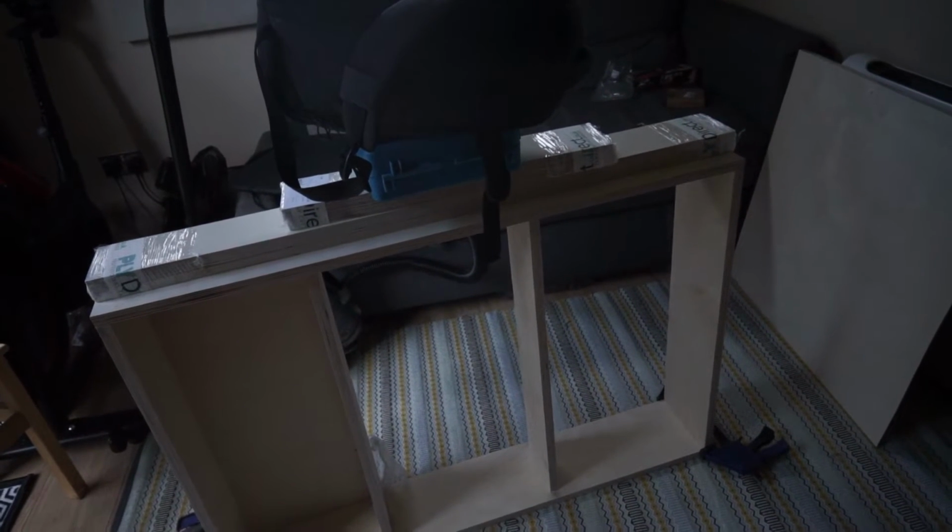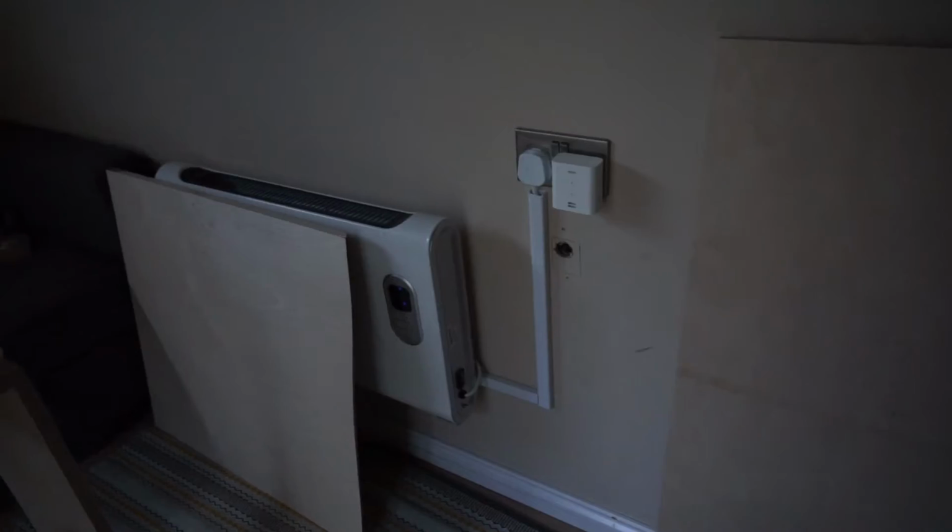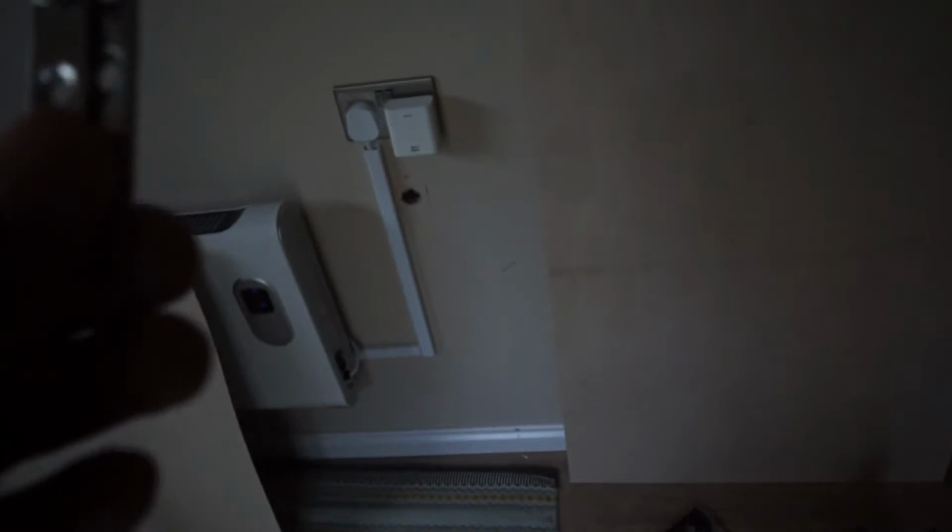So the internal is 96.6, and then you've got the 18 mil either side. What I've had to take into consideration is my hinge, which will be going on to the side, so that's going to be about 5 mil in. So I've got to take into consideration 5 mil plus the 18 mil, which gives me 23 mil. Then also the length of the leg, which is 966. So we've got the 966 plus the 23, which should be essentially where we need to start bolting it together.